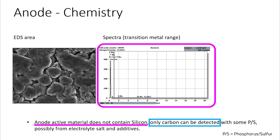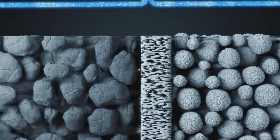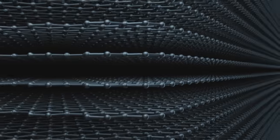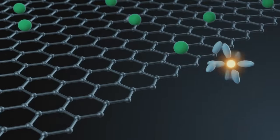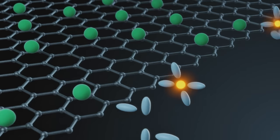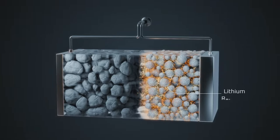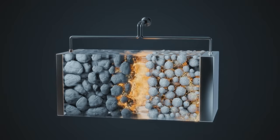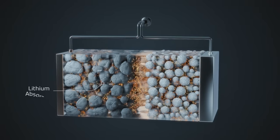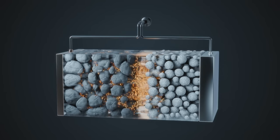Let's look at the implications of a pure graphite, silicon-free anode, starting with energy density. Typically, the anode of a battery cell uses graphite to store lithium ions in a process called intercalation. During intercalation, lithium ions are stored in the graphite host structure at 1 lithium atom to 6 carbon atoms. The benefit is that graphite expands very little during intercalation, which avoids structural stresses in the anode and leads to good cycle life. But the drawback is that the graphite host structure is dead weight, and dead weight has a negative effect on energy density.